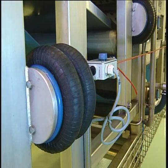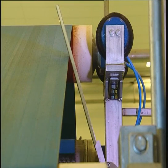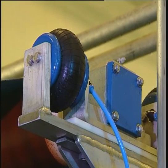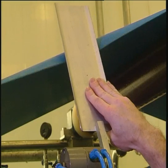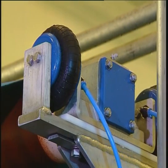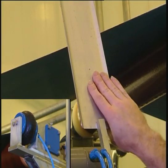The filter belts are also controlled via a pneumatic manifold system. The position of the filter belts on the roller is controlled via paddles. If the filter belts leave their center position on the rollers, the paddles will detect this and the belt will be adjusted back to the middle of the machine via regulating belt alignment rollers.